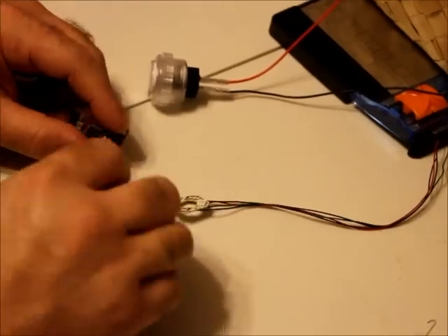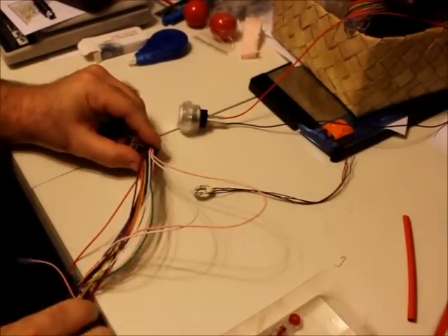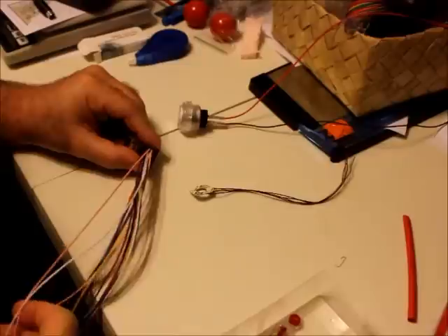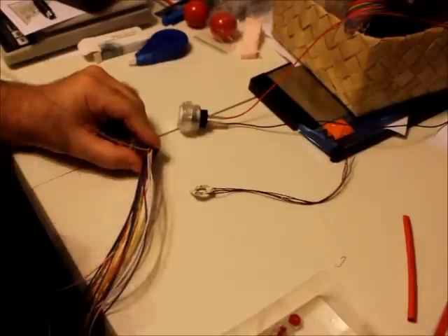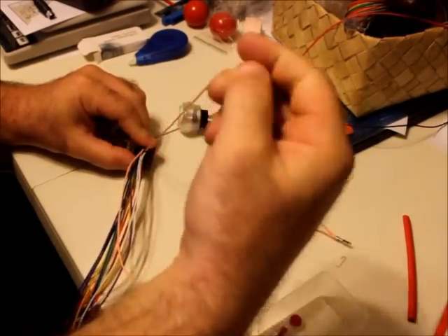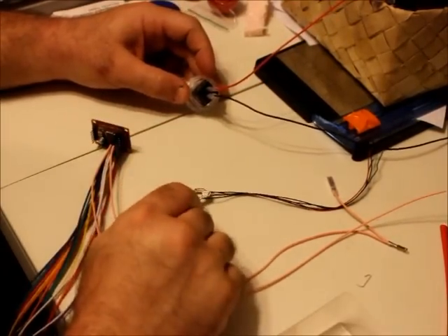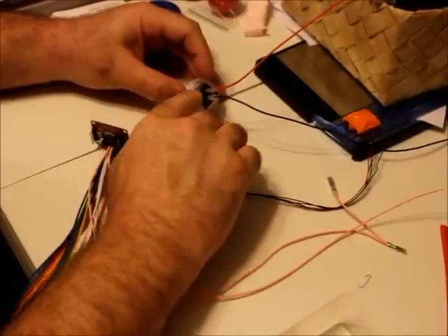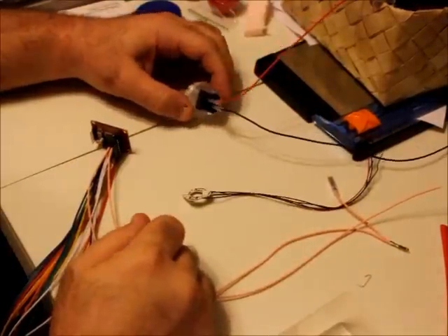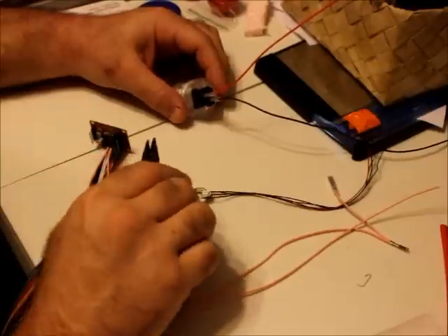Next thing that we're going to do is quite simple. We need to tie into our buttons, and this is something that we do every time with the Sparkys. So we pull our lead out here. Here's our button connection — our first one is pink. To make it easy, if I need the pink power, I come down here and pull on it, and here's the pink power lead. If we were looking at the bottom of the control panel, we'd see the button connected like this. You want to tie the button into the signal for the button, not the ground. There should be a common ground throughout the cabinet or throughout your stick, and you should be able to know what that is by testing it with a continuity tester or by following a number of the guides on modding sticks on the website. It depends on which stick you're doing, but the Sparky does need a common ground.